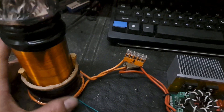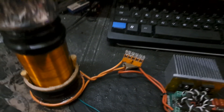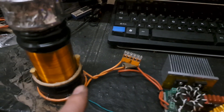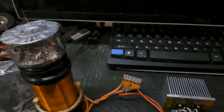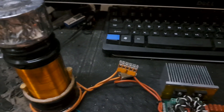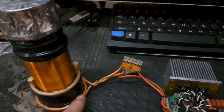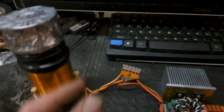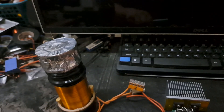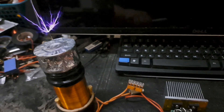I made this very slight change — I've moved the coupling down to where they're about flush, so coupling's a little bit higher. While I probably get a little bit longer discharges to free air at 12 volts with the coupling a little looser, that's just how this all works. At 24 volts, I need that coupling to be about right where it's at — just a little bit higher. That way, when I run this, I can touch the arcs and it doesn't detune it and get it out of whack too much.